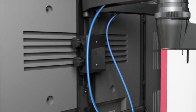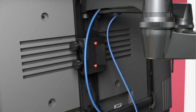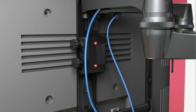And finally, to adjust the roll tension, use an Allen wrench to loosen the bolts on the head of the arm assembly. Using a level, roll the TV clockwise or counterclockwise until it is square with the wall, then retighten the bolts to secure the TV in place. You are now free to enjoy your newly mounted flat panel television.